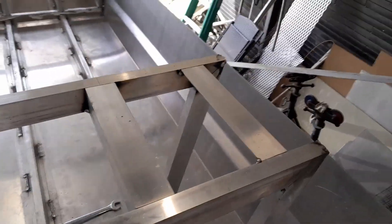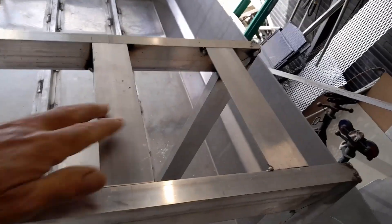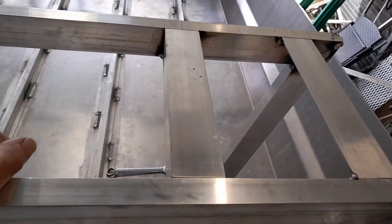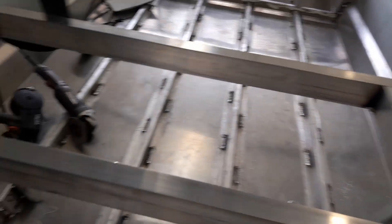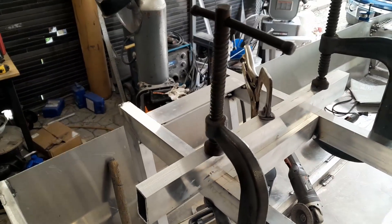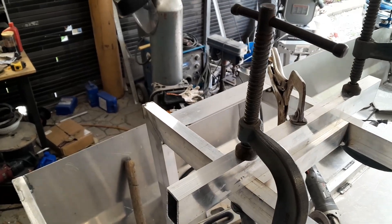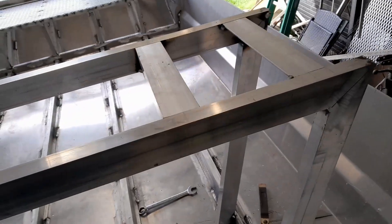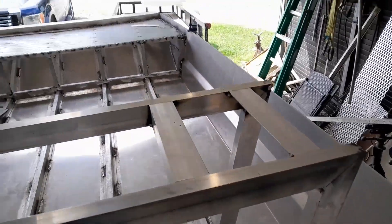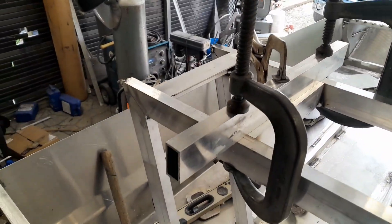What I plan on doing for each engine — got some two by two angle, about 3/16. And I'm going to cap over that with some 3/16 plate. That's where the engine is going to bolt to. This side right here I got to finish getting it all tacked in. After I get it all tacked in, I think I'm going to put a gusset right there in that front corner, same thing on this side.